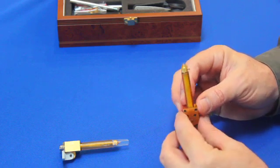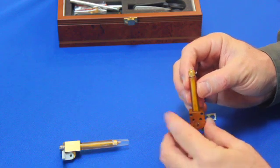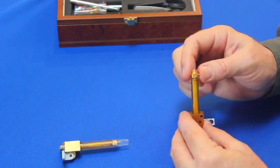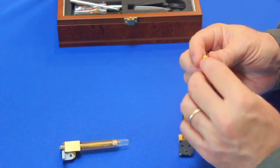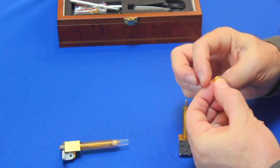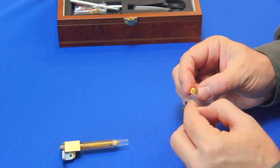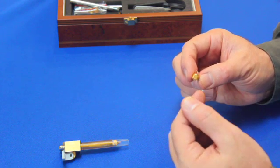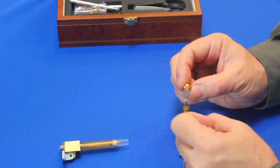On the probe end, we have a new ground collar assembly that has three pins in it that are compliant — they're spring-loaded and can be removed. By pushing the pins from the front side to the back side, we're able to configure the ground configuration in relationship to the signal pins. So you could have ground, signal, ground, signal, ground, or any combination simply by removing one of these pins and reassembling it.